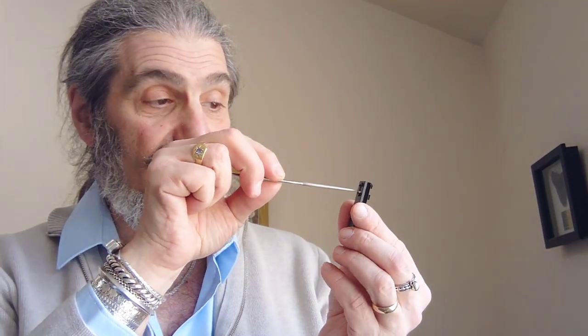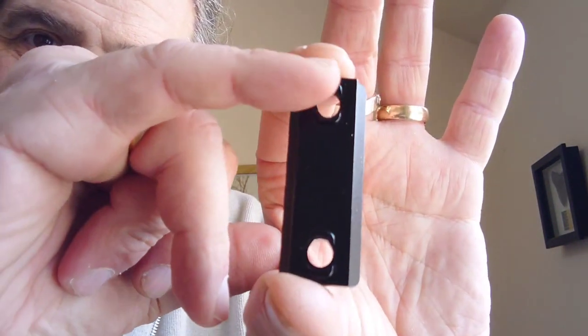There was a simple workaround. I took a couple of needle files - a round one to rough it out and a half-round to finish it off. On the inside of both holes I just filed down, flipped it over, did the same on the other side, and smoothed it off with the half-round. These are diamond-coated ones, but you can find needle files at any DIY store or auto repair shop. Since this is only aluminium, it's really easy to file - a steel file on aluminium goes through like a hot knife through butter. I just had to move the holes slightly towards each other, only a couple of millimeters.